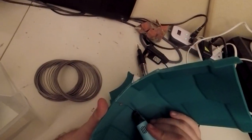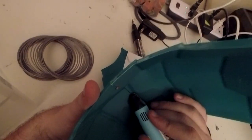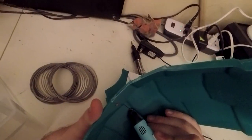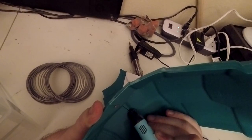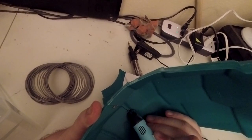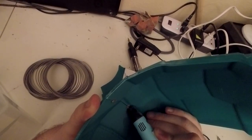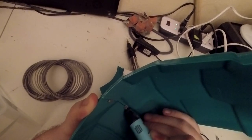For the final bead I'll do something a little stronger overall but thinner, so I can't feel it as easily when wearing the helmet. I go down slower, melt all the plastic on each side of the seam, and actually weld it together.